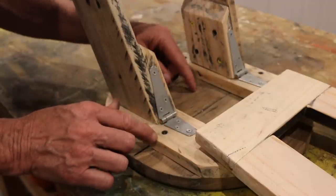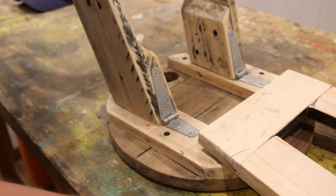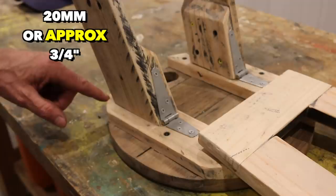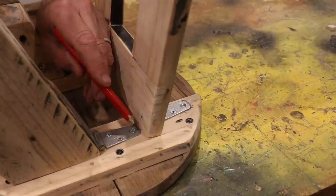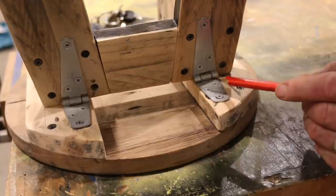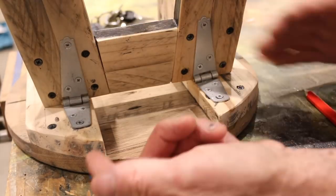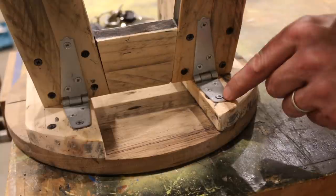For the folding mechanism, the front legs fold back just like that and the back legs come up and down in a similar fashion. The back legs and the front legs are centred over those outside pieces of pallet wood. For the hinge position on the front leg, I've come back from the front of the leg 20 millimeters — about three quarters of an inch — and then screwed down that hinge. For the back legs, I've positioned those about three millimeters — one eighth of an inch — away from that front hinge. To position those hinges correctly, place the legs on top of that seat base at about a six degree angle, then grab your hinges, slide them hard up against that leg and hard down on the base, screw in place and you're good to go.